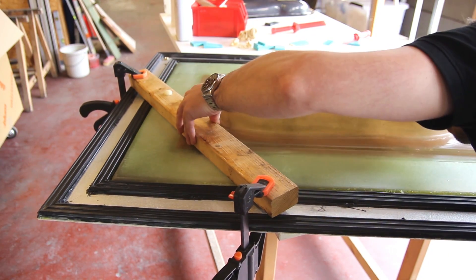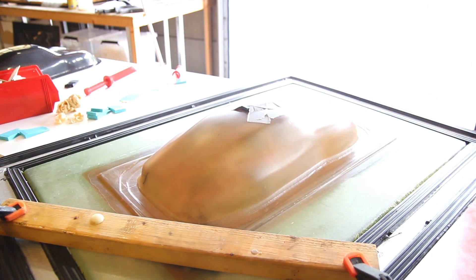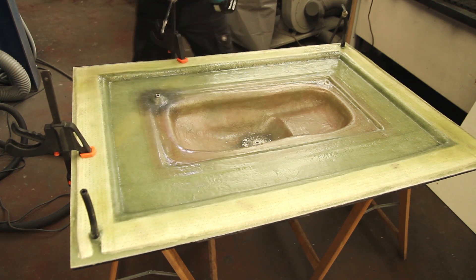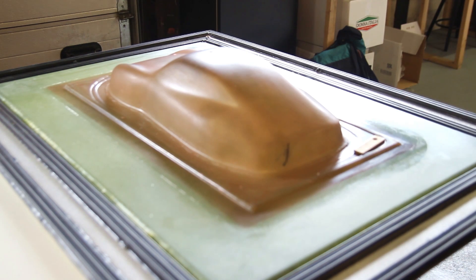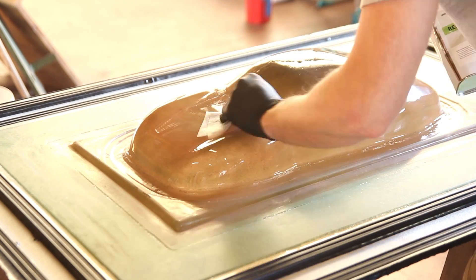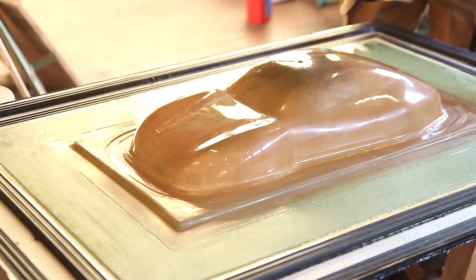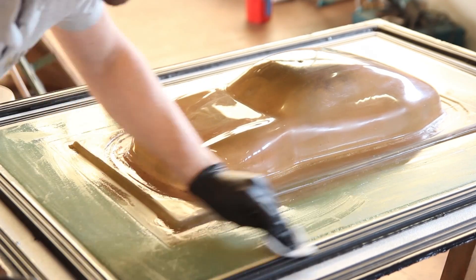I still need to figure out whether I'll be infusing from the sides — around the perimeter of the car shape — or from the inside out; probably from the outside in. I'm drilling out the holes now — this will be the infusion inlet or the vacuum side — and then we're close to finishing this mold. Once the inlet and outlet are drilled, you add release agents and you're ready to make parts. I hope you liked this video — I'll see you in the next one, so thanks for watching, and don't forget to subscribe and leave a like.